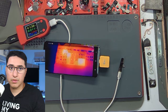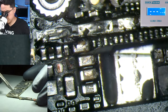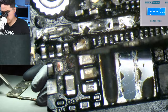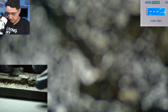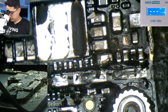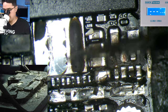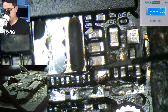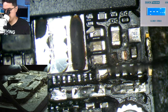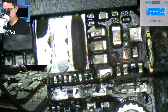Take a picture. This time it looks like it's that largest cap in the top row. Let's go back under the scope. I kind of suspected something was up with this one. Let's see if we can pry it off. You can see like the top layer just chipped off. It's not coming off so easily, so I'm putting it on my board heater and then I'm going to pick off the underfill.